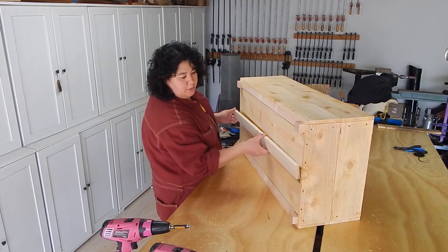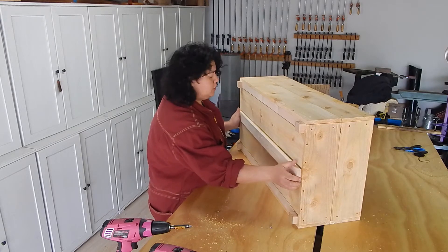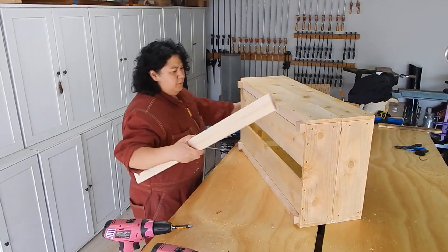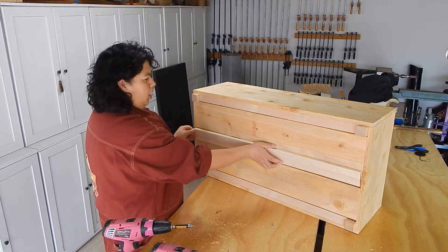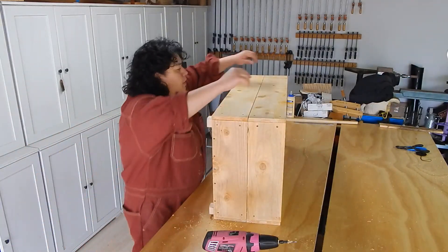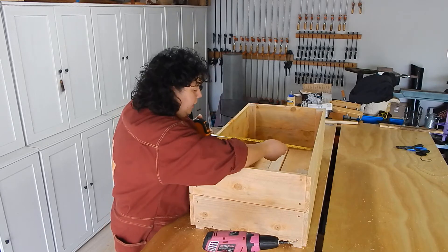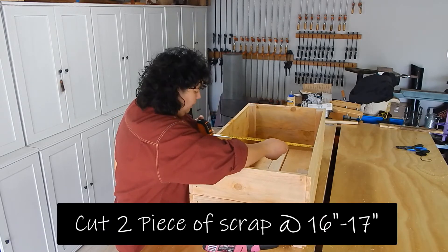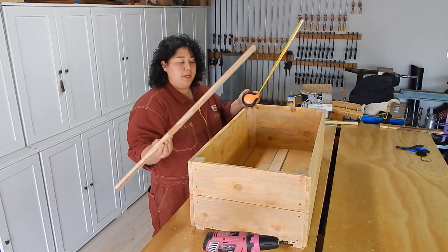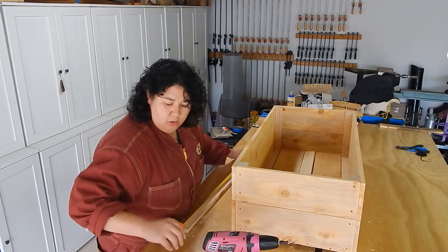In that center I have that same issue. Because this is wet wood — it's wet fencing — it's not always straight. Even though your cuts can be perfect, you're working with a material that's kind of always moving. I'm going to take a little bit off of this one — it was just slightly snug — so I just took off about an eighth of an inch. We are almost done. I'm just going to put in those two pieces and measure for those — anywhere between 16 and 16 and a half inches, or up to 17. I'm just going to use my leftover piece of the 1x2 and cut that in half, which should be about 16 inches, and that should give me enough to get in there and secure it down.